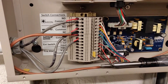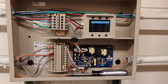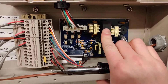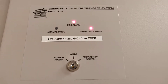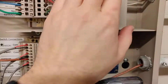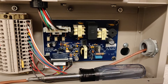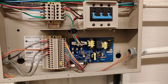I already spoke on the phone with ETC about this problem and they had me run some tests. We determined that this relay right here — the switching relay — is faulty. It's just giving a faulty signal to the transfer switch and everything else. So I'm going to replace this control board, kill power to it, get the wires off, and put the new one in.